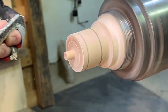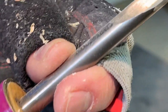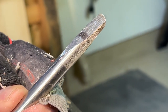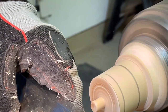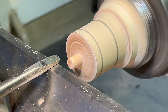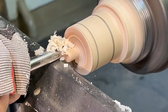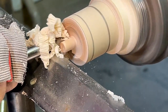I made myself a scraper — it's almost just a square scraper but with a slightly rounded tip to the top. It was an old quarter inch bowl gouge that was worn out. Now I'm going to introduce it at a slightly downward angle and hollow it out. I've marked about a half inch mark on the tool bed so when I shove it in I'll know how deep I need to be. If you don't take enough weight out of the top it's not going to flip, and if you take too much out it also won't flip. The depth is about a half inch.